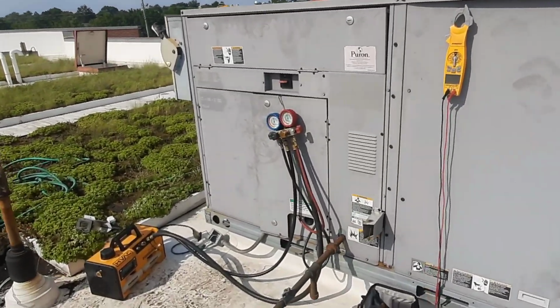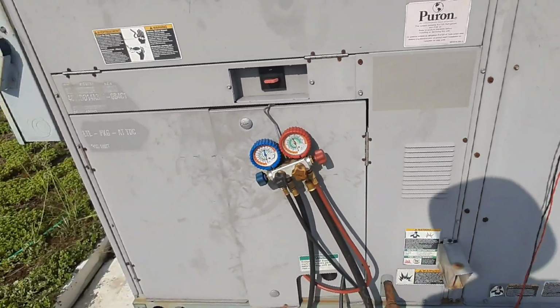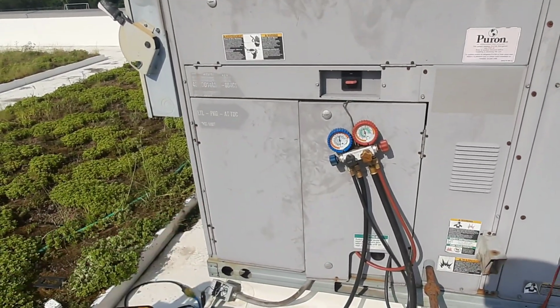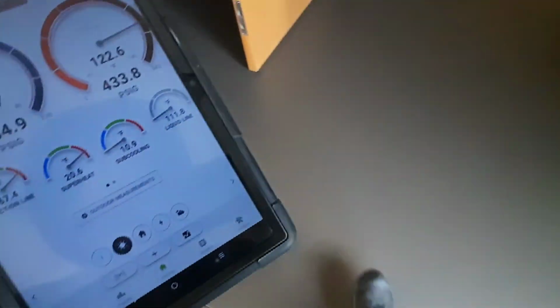We'll see what happens. If the restriction comes back, we know it's in the oil. We can get a few more years out of this thing, they'll be all right. So the bigger dryer should help. I wish I had a 16 for the other stage, but I don't. So it's gonna get what it gets. About 2,000 microns. We're getting there.